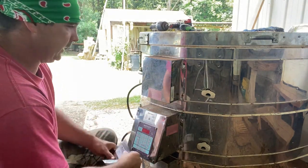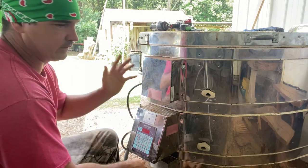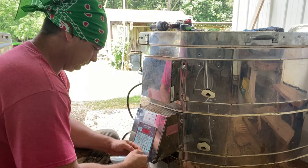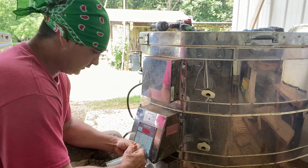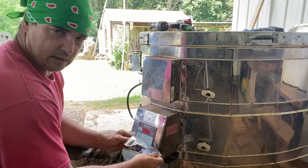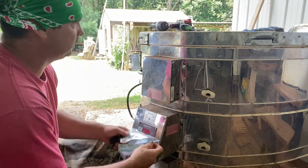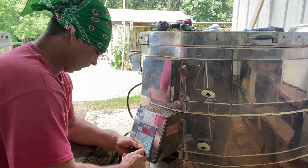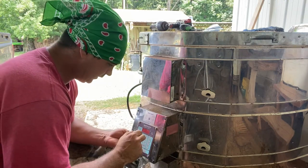The only thing that hasn't been done is all new elements, but I have tested the elements — I've tested the resistance on them. Pretty much all this kiln will do is bisque. I burned these elements out the last two times trying to glaze fire one more time, but these are prong-bent on that one.